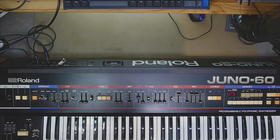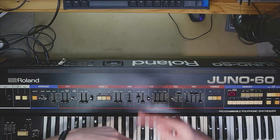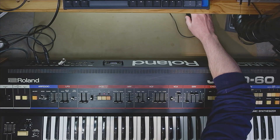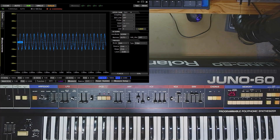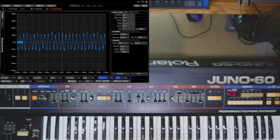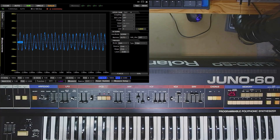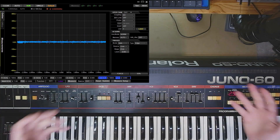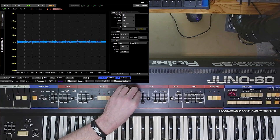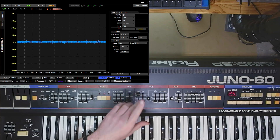It's in test mode so it's cycling through all six voices sequentially, and one of the voices is FM'd and distorted — it's an annoying tone. You can see it on the scope. One of the six voices is resonating or oscillating. When I have the filter all the way open it's not happening.